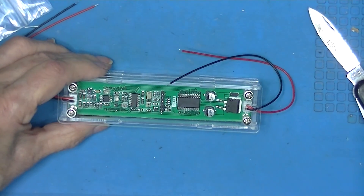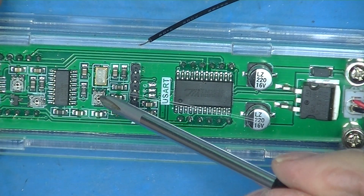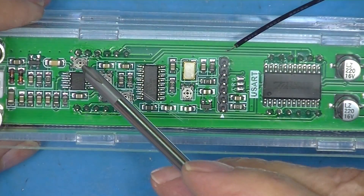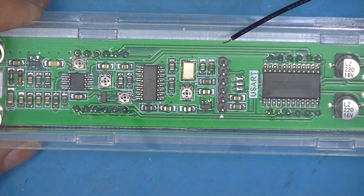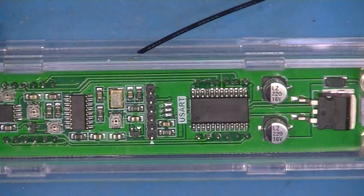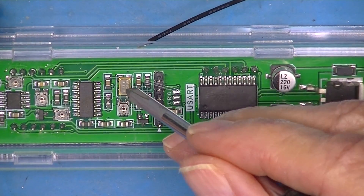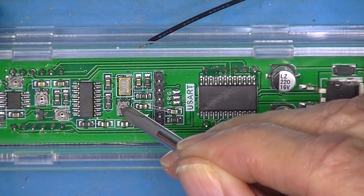Let me get in a little closer. Right below there is an adjustable device — that's an adjustable device, and that one too. I'm going to try to find out what these are, then mark their location and drill very small holes in this black panel so I can access them. This one I believe to be the crystal, or possibly an oscillator. I'm thinking that with the proximity of that device to this oscillator, it may allow me to correct the frequency.